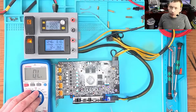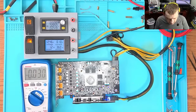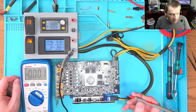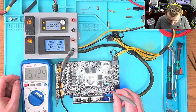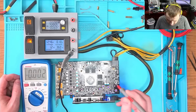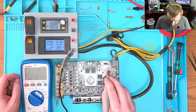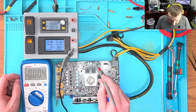Drawing 0.1 amp means something on this board is not working and we need to find out what that is. I'm gonna put this probe in here — the first thing I want to check: do we have 5 volt? Yes, right there we have 5 volts. Do we have 1.8 somewhere? This is probably PCIe — this is probably 5 volt here. Memory? Nothing. 12 volt? Nothing here, but I don't know what this is.